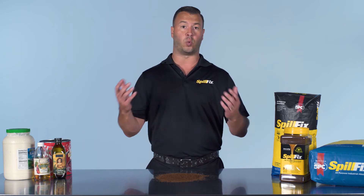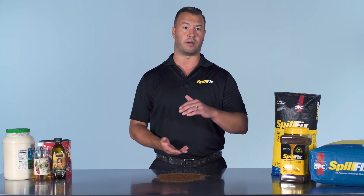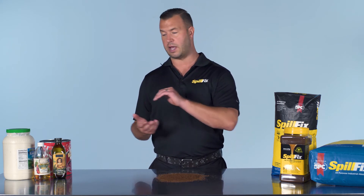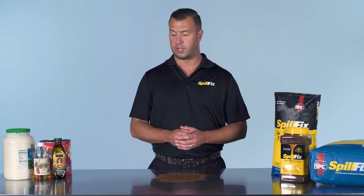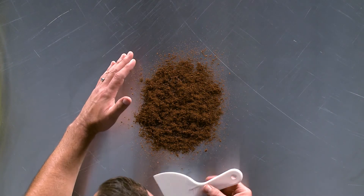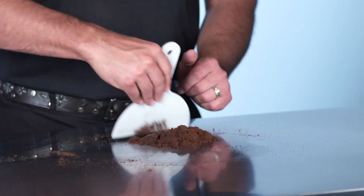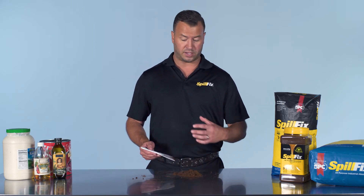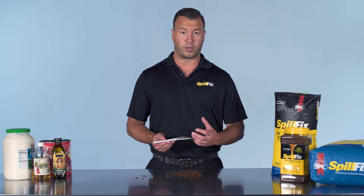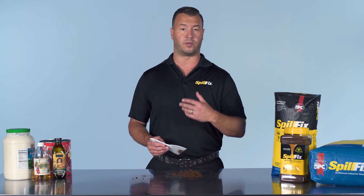Using SpillFix in food manufacturing facilities with olive oils and vegetable oils eliminates a major waste stream — actually completely eliminating it. They no longer have to put it in 55-gallon drums and pay folks to come pick up and dispose of the waste, which is very expensive when using clay at 18 to 20 cents per pound. With SpillFix, you apply it directly to the spill — no waiting, no downtime — quickly move it around and you're finished. It stays very light and loose, so you sweep it up and reuse it. When saturated, you can safely dispose of it in a landfill, which you cannot do with clay products, kitty litter, or oil dry.